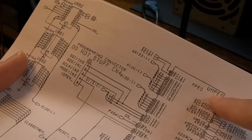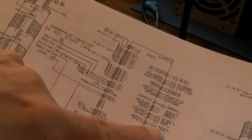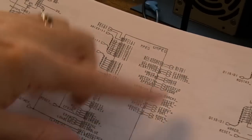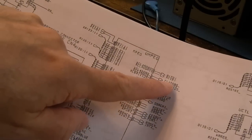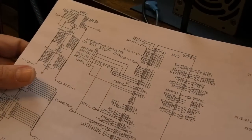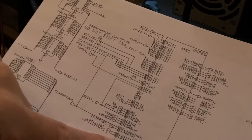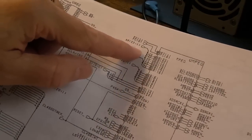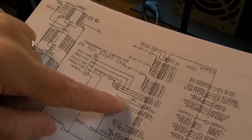It probably communicates directly with the CPLD - the lattice CPLD. Looking at this CPLD, it's doing stuff related to interrupts, ROM enable, address decoding, config out, config in, bus protocol stuff for communicating with this as a memory-mapped device. There's the CL450 control signals, the L64311 data strobe - it's a bit of glue logic. The CPLD is the interface into the MPEG chip, doing address decoding for different things, interrupt handling for the ROM, and interrupt stuff for the audio chip.